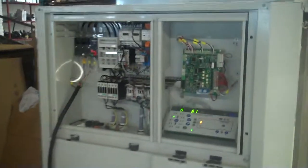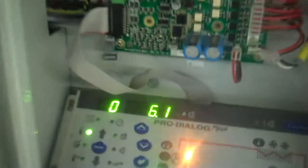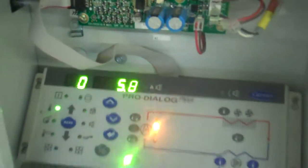This is our video 3 of the 2010 AquaSnap Pro Dialog Controls. Our entering water temperature is at about 5.9C right now. It's probably going to shut off before that entering water temperature reaches 5C exactly, just due to the algorithm and the controller. So we're at 5.7C.